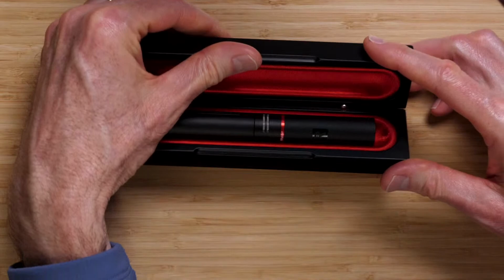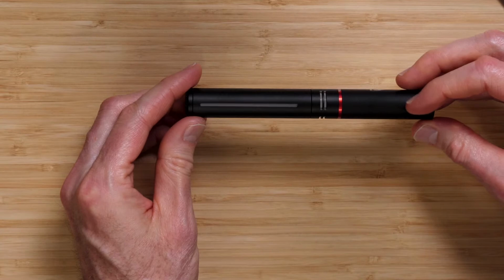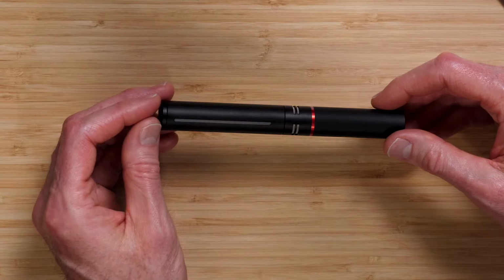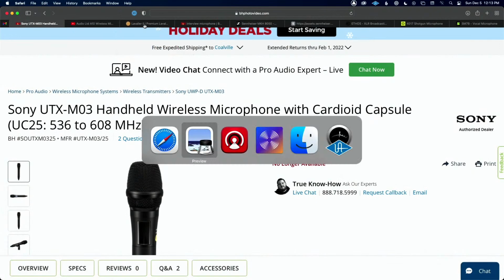All right. I want to talk about shotgun microphones. Again, this is the Rycote HC15, so a 15-centimeter shotgun microphone. And this one, they actually cite it as having a hypercardioid polar pattern. So they don't actually call it a lobar or a shotgun. They call it a shotgun microphone with a hypercardioid polar pattern. And let's take a look at what that looks like. So if I pull that up over here on the Mac,